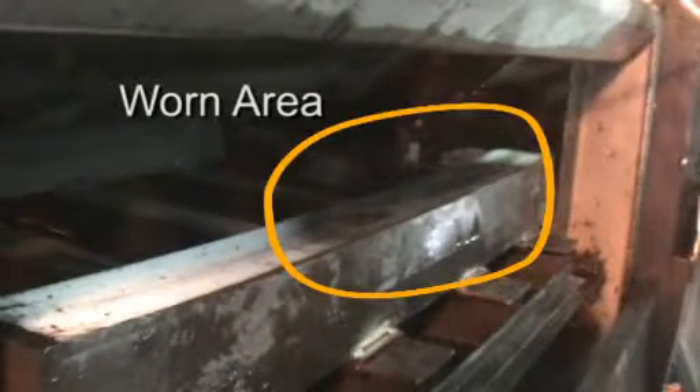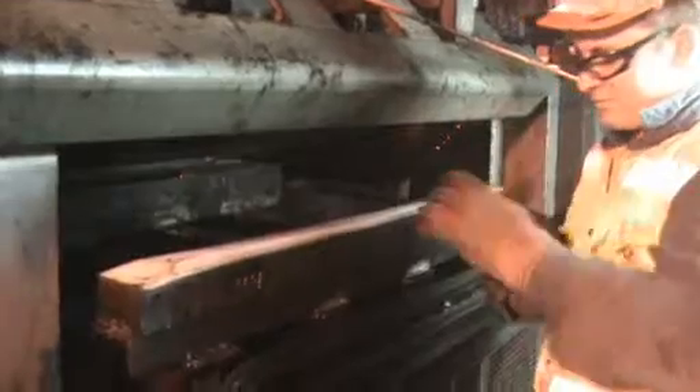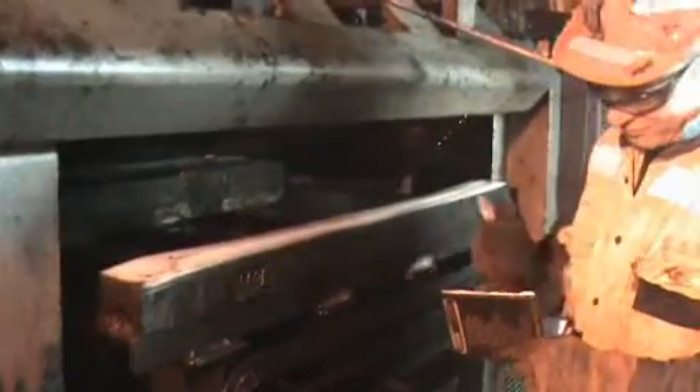The centre bars can now be accessed for inspection. Carefully inspect each bar for top cover wear. If the top cover is worn excessively at any point, the impact bar will need to be replaced. Note the wear on all bars at each service so bar replacement can be anticipated and spare parts can be readily at hand.